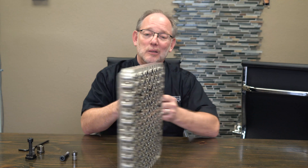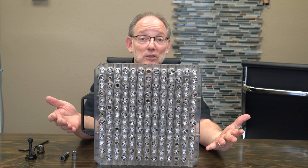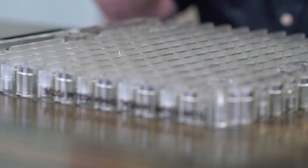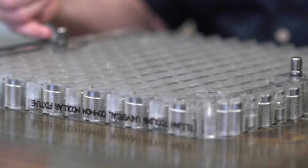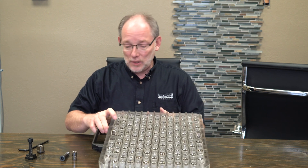Another question we're going to talk about is how are you going to locate the plate — in other words, we're talking about the back side of the plate. How are we going to locate it? Are we locating it on a T-slot fixture? Are we locating it on a flat surface, like a tombstone or something like that? So typically you're going to have some kind of location. This particular plate has round pin locators — here we have our zerts, our retractable dowel pins to locate it. But we're also going to need a way to connect the plate to, in this case, a tombstone. You can see ours is a little bit unique because we have take-up holes for our invertible fasteners.